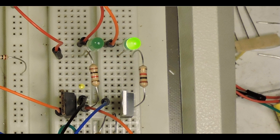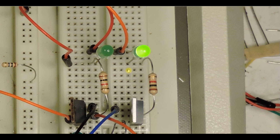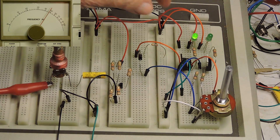Here are our outputs. You can see I've got the left diode shorted out and the right one is operating. The circuit is in resonance right now — the right LED is on. When the left LED is on, it's out of resonance. As I move above and below resonance, you can see the lights flash back and forth.